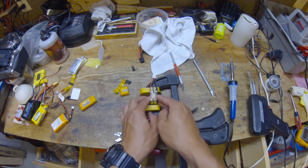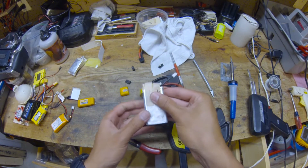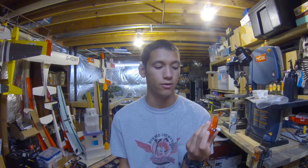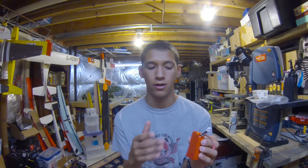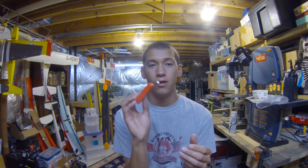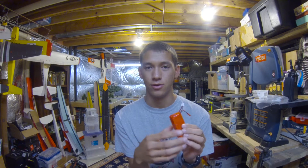I'm going to reuse this tape to cover up the solder joints to avoid short circuits, then wrap this in some colorful tape to finish it off. Here we have the finished 2-cell battery. You could cover this in heat shrink if you wanted to, but I don't have heat shrink that big. Make sure you do not short your cells out when soldering and cutting the tabs, and do not puncture your cells at any point — you'd have a bad day. It is kind of dangerous but it does give your batteries a new lease on life and prevents you from just throwing them out.